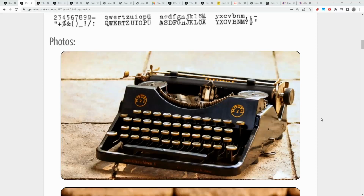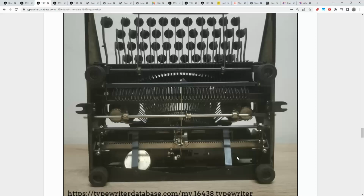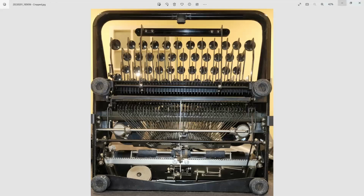As for mechanical changes found in the later models, I'm going to be referring to these different links here, mainly from the typewriter database, links in the description. So yeah, that's what your Juwel Model 2 looks like. Now in terms of underneath the machine, we can see here that compared to on my Dankers, as well as other photos of this model, it's basically the exact same escapement design, where you have a rocker that engages directly with the carriage rack. Likewise, there's no bell, and yeah, all the other mechanisms are virtually the same.